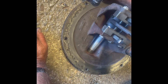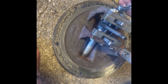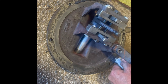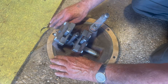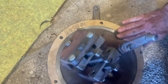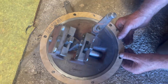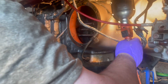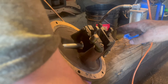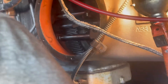We're going to put the side cover on, so we're gluing the gasket to the side cover so it'll stay in place — the gasket does the sealing, this just holds it in place. When installing the side cover you have to make sure you line it up with the shift rails for the transmission. Inside, you have to make sure the rails go into the notches on the shift rails.